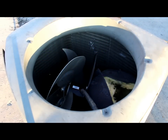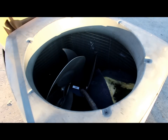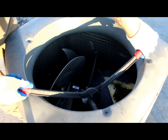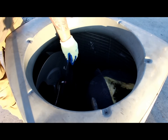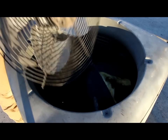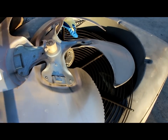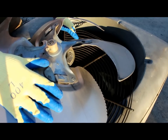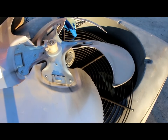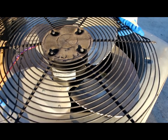So as you can see here, somebody's already tried to take the motor out — they unscrewed right here, here, and here. Normally it's screwed on at the top. We're going to go ahead and take that off, grab these loppers, cut these wires, and pull that sucker out of there. So we have our motor fan here. Sometimes these blades are aluminum, sometimes they're iron — you've got to check it with a magnet to tell. Sometimes it easily comes off right here, sometimes it doesn't. Sometimes I cut the rod with a Sawzall — I'll show you all that in a bit.